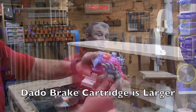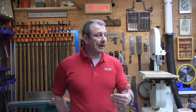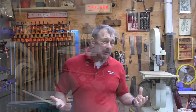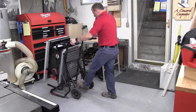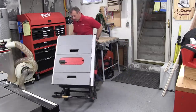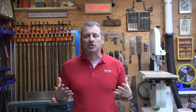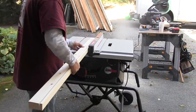The saw mounts on a pedal-activated lock-release stand that is easy to open and fold with a single pedal press. It's a tubular metal design that stores vertically or lies horizontal in transport mode, functioning like a dolly. The 8-inch wheels work well on rough terrain and residential stairs — regardless of brand, 8-inch wheels are a sweet spot for jobsite portability.